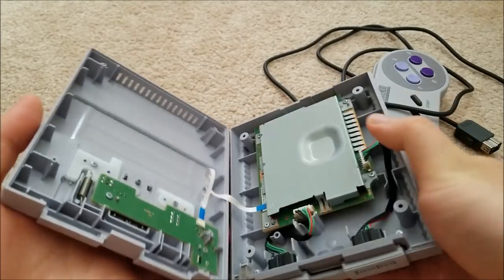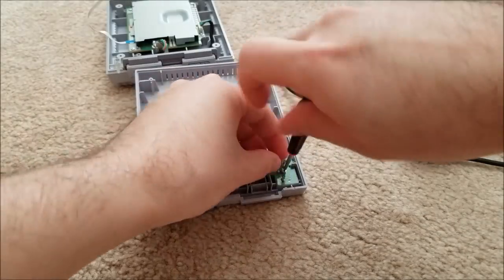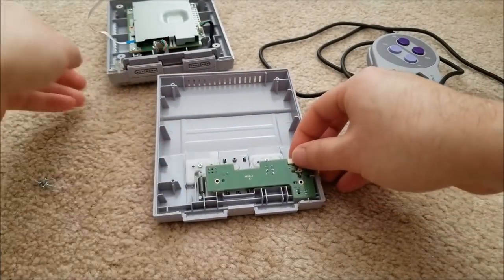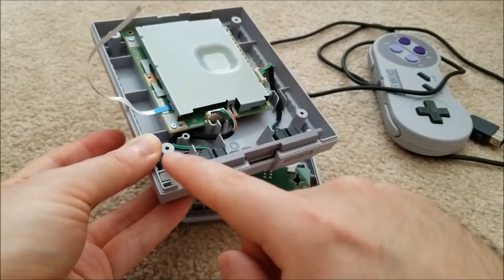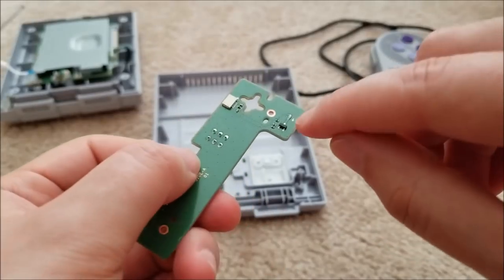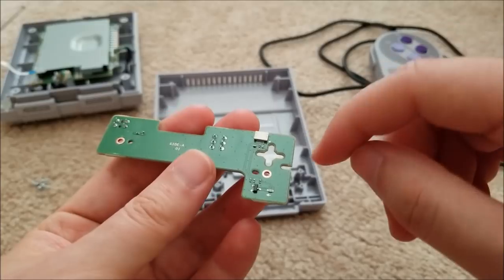Be careful, there is a ribbon cable — just going to detach this. On the other side of this board there's pretty much nothing, other than an interesting design choice: they put the LED indicator on this top board. It's down-firing, and there's a light pipe which redirects the light perpendicular to it so it comes out the front. It's a tiny LED, so you can change it to whatever color you'd want, and it's controlled via a transistor so it can blink to show different codes.